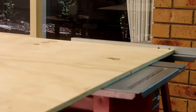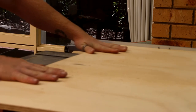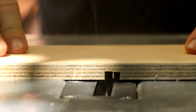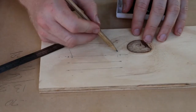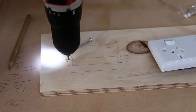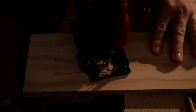To start off I had a 1200 by 1200 sheet of plywood which I cut down to size. I also cut some grooves into it so I can have some nice slotted pieces inside to give a good grip. To install the components I had to measure out where they'd go — first I'd drill the holes for the screws, but in most cases I also had to clear out some space where the actual components would sit through the wood.